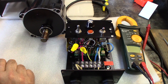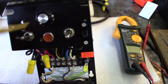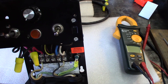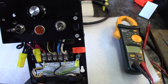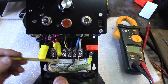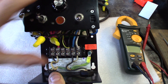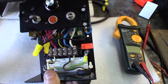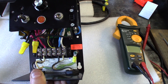Opening the cover, the inside is pretty straightforward. There's a small switch that says 115 — if you flip it you go to 230. If you've got 240 or 220 that will work no problem. Here we have 120, so 115/110/120 — no problem whatsoever. Simple to connect: line input and DC output on two connectors. These may not be the most recent units, but hopefully newer units are a little clearer inside.